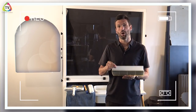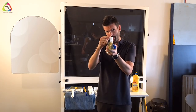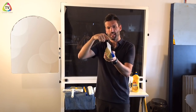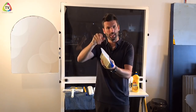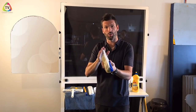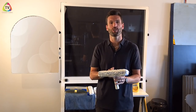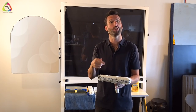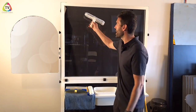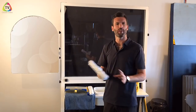The Aquablade is silicone — it's why it works so well, and it's also why you want to bend the blade to clean the window. Your silicone actually has two lips, one on each side. Each one is good for about four years, so it doesn't mean your Aquablade is done after four years. When the one side wears down, you're going to unscrew it, flip the blade, and re-screw it back on — now you have another four-year life with your silicone Aquablade. The other maintenance will be your microfiber wash pads. They're microfiber, like all the best cleaning cloths. When you wash them in the washing machine, any cycle's fine, but no fabric softener. You won't ruin the cloth, but if you wash it with fabric softener or in the dryer with a dryer sheet, you are going to get streaks on your glass because you'll be spreading the fabric softener on your glass. So washer and dryer is fine, but no fabric softener, no dryer sheets.